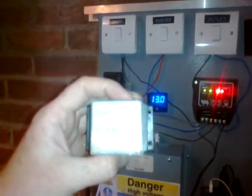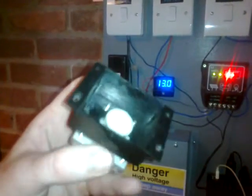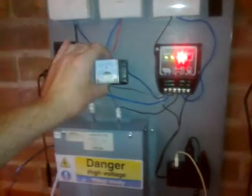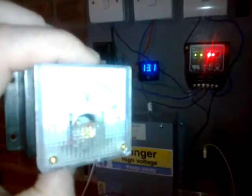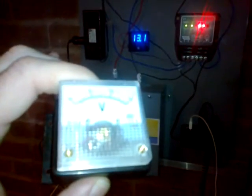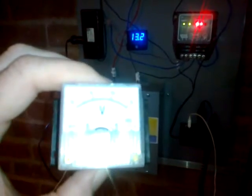I've ordered one of these little mini ones, it's about two inches in diameter. I'm just dremeling out some plastic so it can fit in the housing and screw in place of the old one. It's a 15 volt - it's hard to find the 15 volt; the majority of them are higher figures and the lowest I found was 20. Then I randomly came across this mini 15 - it's hard to see because of the light - BF 15 volt DC mini analog panel meter.